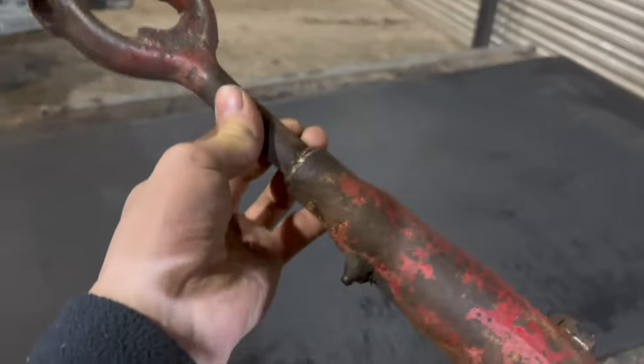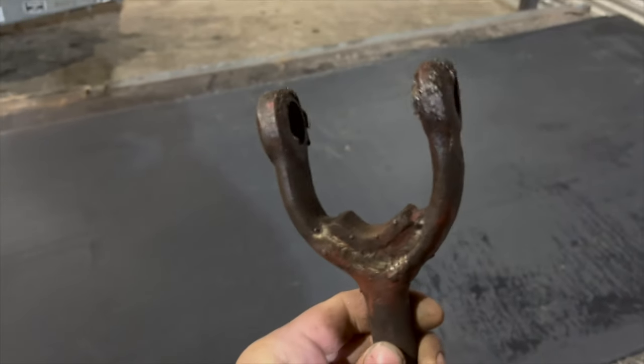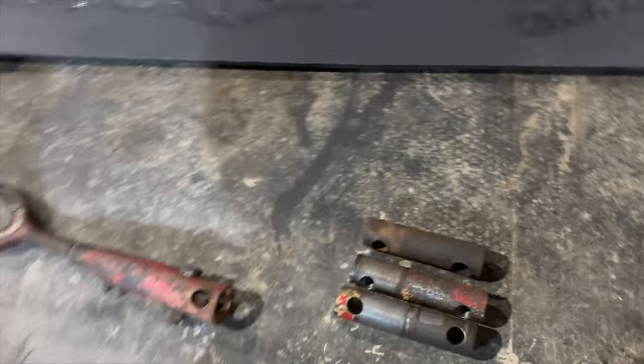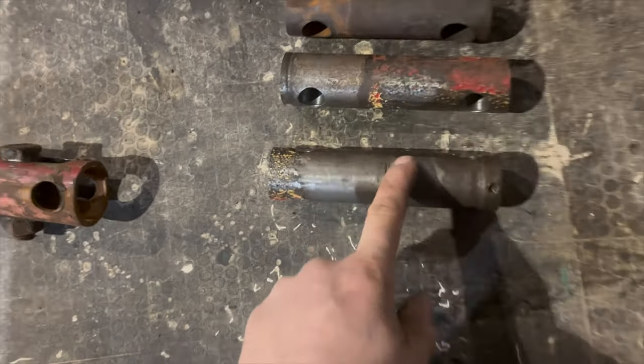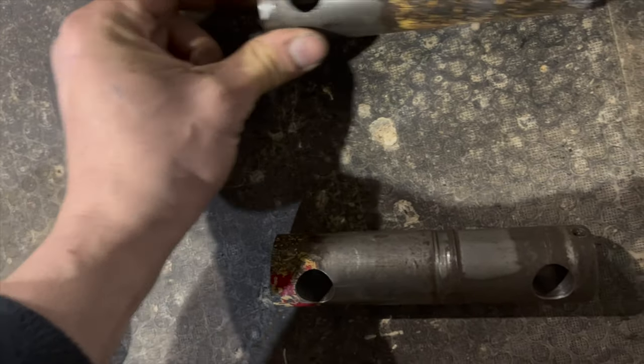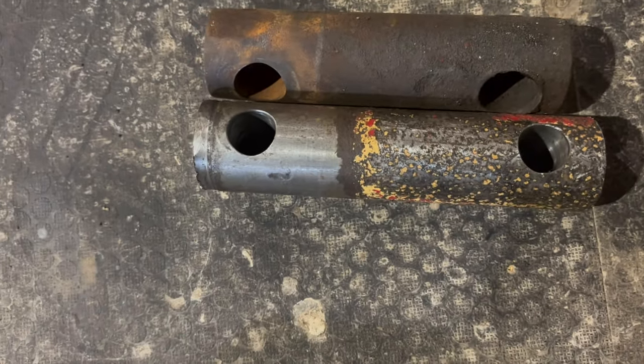So I've taken this one off, which has been abused and welded up — you can't wind that one out. These are the pins that Andrew made us. I cut them down and recycled them — they're off the baler shaft on the thumping unit. It had worn that much. So that's the original. He's drilled them on the outside edges. They're maybe half an inch longer, but I think they're going to be better. There's a four-and-a-half-inch difference between this one and the other one, so that should make it a lot better.